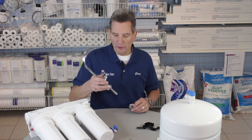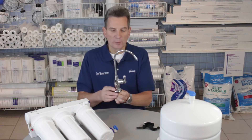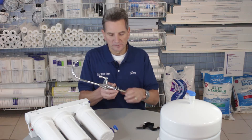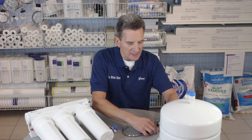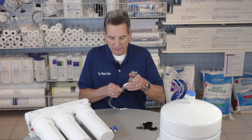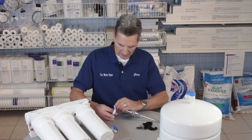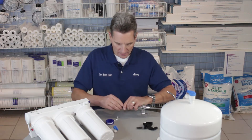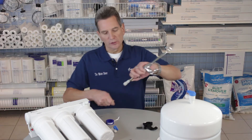When you install the faucet, once you've drilled the hole, the chrome piece goes on the top and a rubber washer goes underneath. You position that into place, then from underneath you put on the big washer, the lock washer, and the nut. Tighten that up and position the handle on the left or right side as you prefer. Then this fitting goes on the end — put Teflon tape on the threaded portion, give it three turns, and tighten the fitting on. This will be under the sink already, and then the tubing connects to that.